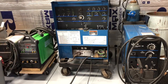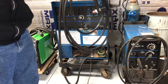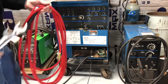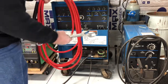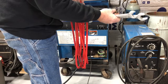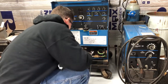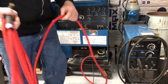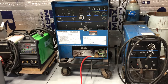I'm changing out my torch for this job, because what I got on the machine right now is my 200 amp dinosaur air-cooled torch — that's just huge and hard to deal with. It's awesome for welding thick stuff, but I have this nice flex hose rated for 150 amps and I don't think I'm going to be exceeding that. It's got a flex head on it — super flexible. These things are awesome. This is from CK Welding. The other torch is like fighting a frozen garden hose, and trying to weld with something like that's a real pain.